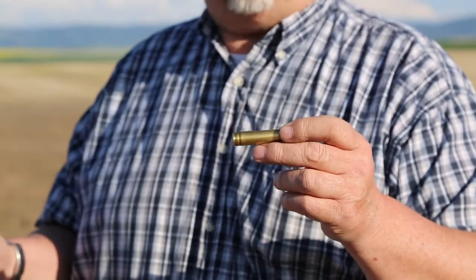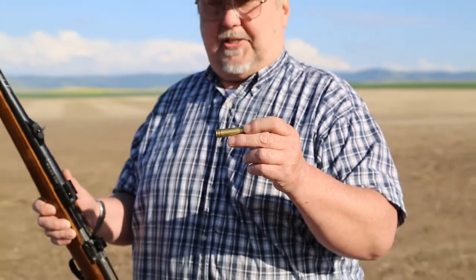That's how you solve the chicken and the egg problem. You start out with a really home-brewed step-down in stair steps — a .375 case — then trim it and stuff a blank load in it with a false shoulder so it can't jump forward on you. You shoot it in your 8mm magnum chamber. I went into the bottom of a drawer and scrounged these up, re-blanked them with new primers and new cream of wheat loads — 15 grains of DuPont 700 shotgun powder — and away we go. Presto, a brand new .416 case.